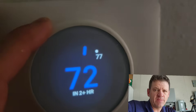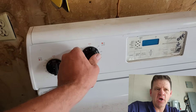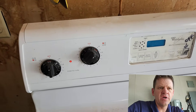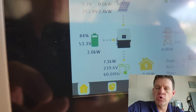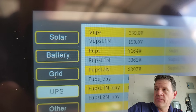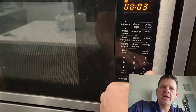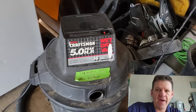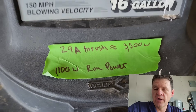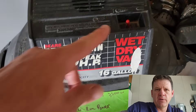For my heavy unbalanced load test, I started a few big items: my air conditioner, an oven burner on L1, and on the L2 leg I started my microwave. After the microwave was running on L2, I tried to start my shop vac on L2 as well — it has a good inrush current and it was able to start that just fine.